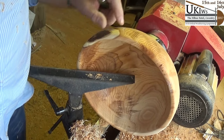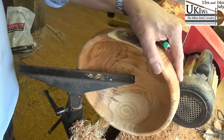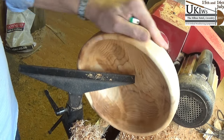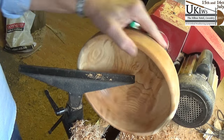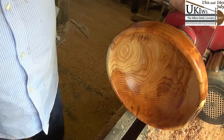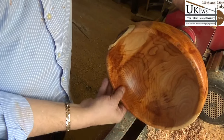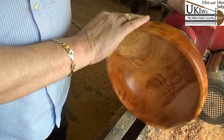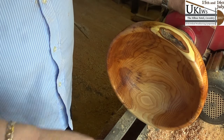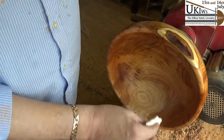There's a question now of polishing or sanding it up, which is going to take quite a while. The usual rules apply: sand it to 240 grit, sanding sealer, Yorkshire Grit, give it a polish. I've sanded it and Yorkshire Gritted it, and now I'm just going to apply some Hampshire Sheen Original — I don't want too much of a shine on it. I'll give it a good couple of coats of Hampshire Sheen Original and then some microcrystalline wax over the top for extra protection.